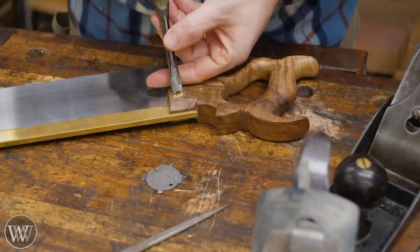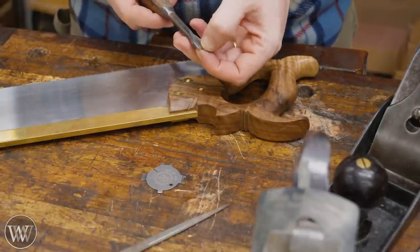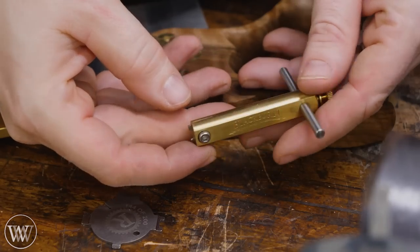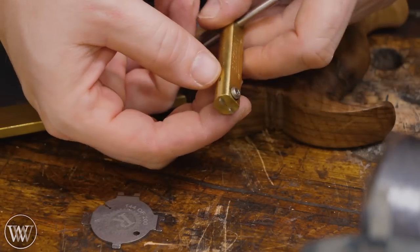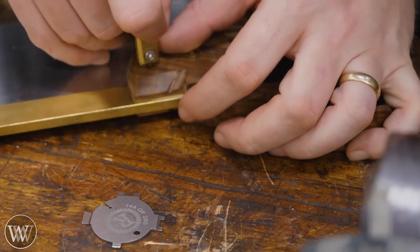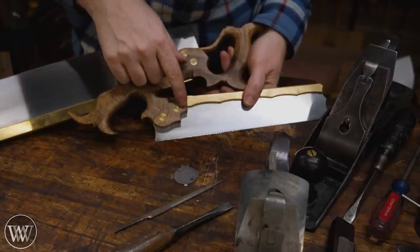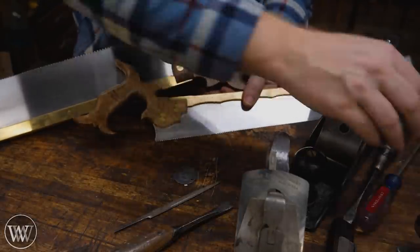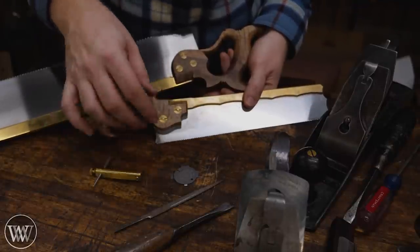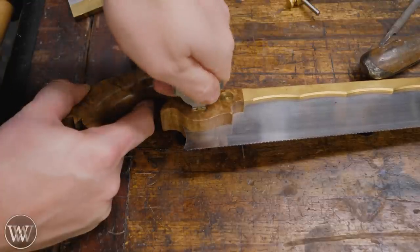But the really cool one is split nuts. For this task I took an old screwdriver and filed it down — and there are a few antiques you can get that will work. But this one I've actually ruined over the years and it doesn't quite fit the slot anymore. I've got this really cool one from Blackburn Toolworks with a rod that goes through there and an adjustable head, and it works really well and it's incredibly tight. But I've actually found problems with scratching things up because it's so tight. And then another common problem is that they come in different sizes — a larger nut and a smaller nut — which means I need multiple specialty screwdrivers.